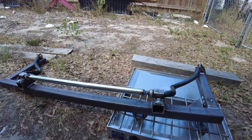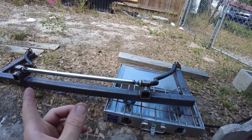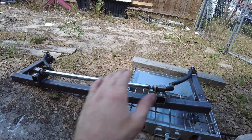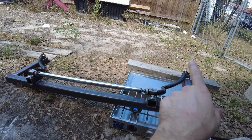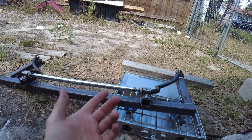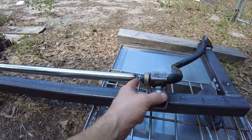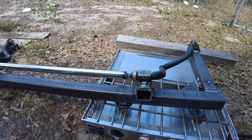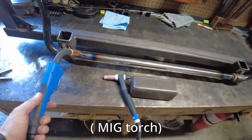Do you need to preheat? No, absolutely not. But with this sway bar we've got four mounting points that have to be in the right place relative to one another — chassis mounts and spindle mounts — and they can't move. That's why we're preheating. Another thing preheating can do is condition your weld: if your welder isn't powerful enough, you can preheat to get the material up to temp. That's especially important on a MIG weld where you can't just sit there and heat.